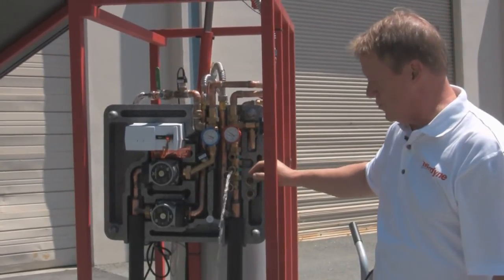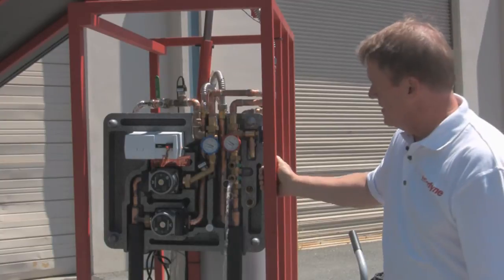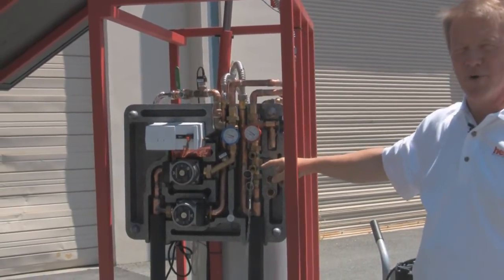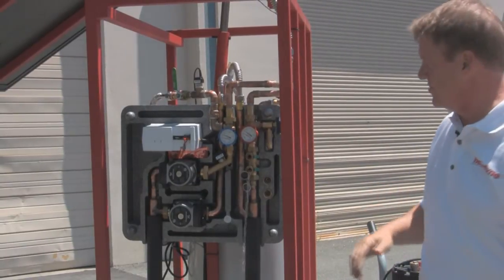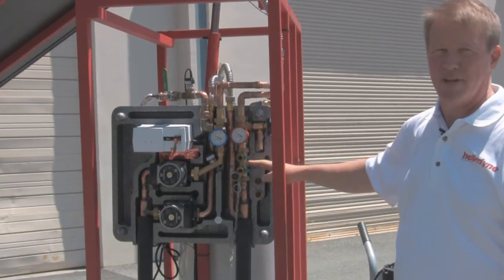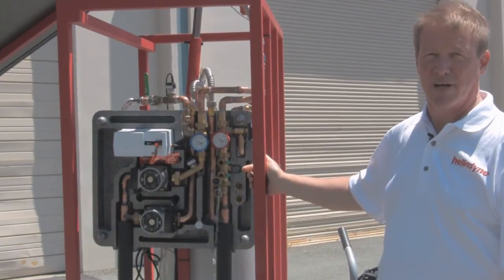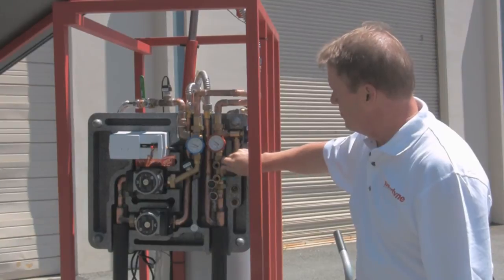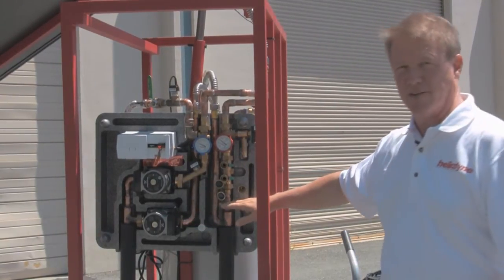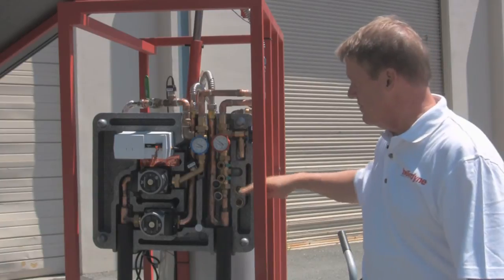Normally I would keep a pipe on here to avoid making a mess on the floor, but I'm removing it so you can watch the drain. Air is going in the top, traveling up through all the piping, and all the piping is draining through the bottom. Normally we have to open a high point on the roof so air can come in and drain the system. There's not really much water in here — this H-Lab holds only about a gallon. In a real setting with domestic hot water and one collector, you'd normally see about four gallons of water-glycol mixture. At this point the system is empty and ready to fill with glycol, though we do have some water still sitting in the bottom of the heat exchanger, which we'll address when discussing how to mix glycol at the correct ratio.